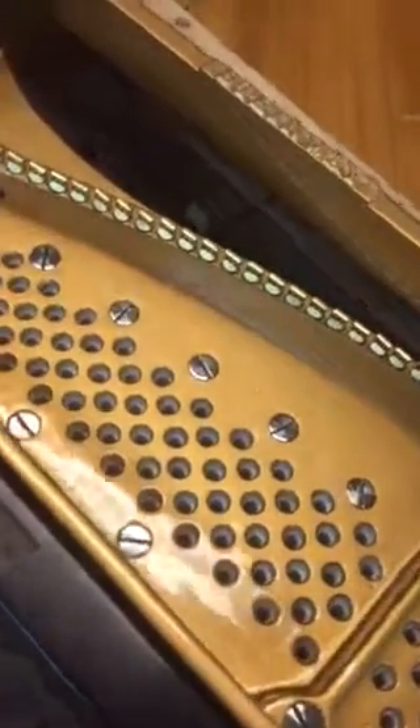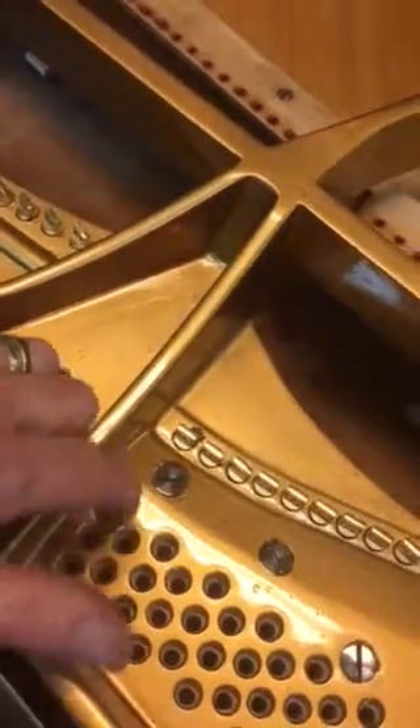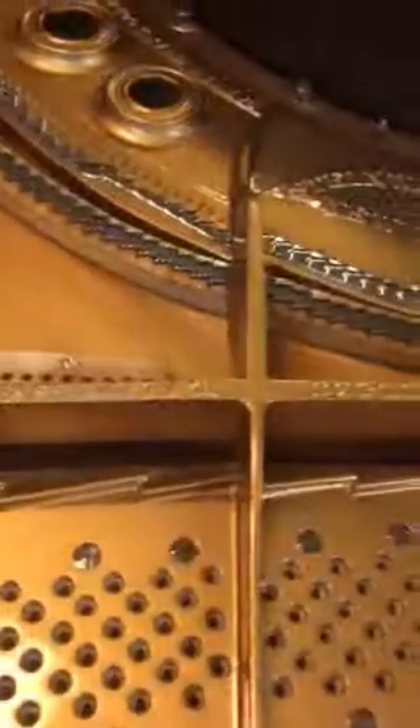So that's all I have to report on thus far. I'm very, very happy the way the pin block — which is the block of wood that's underneath the plate — worked out. That's the muscle of the piano. I just drilled all these holes in the pin block this morning, and the tuning pins will go into each one. There's a little bit of a ding here which I have to touch up, and I usually wait till the end and touch that up with the gold paint. So there we go.